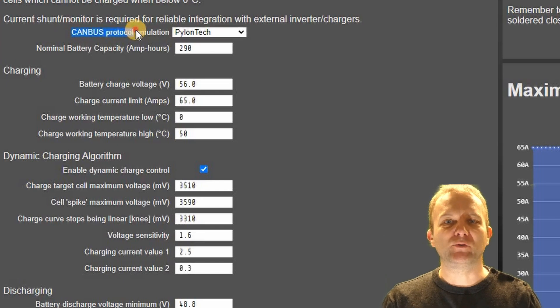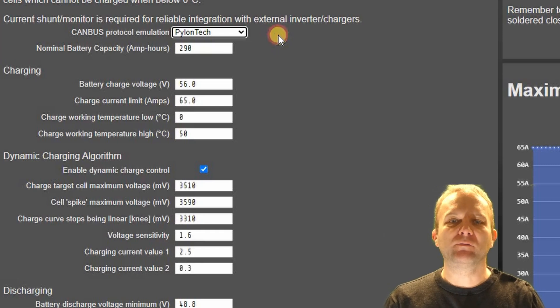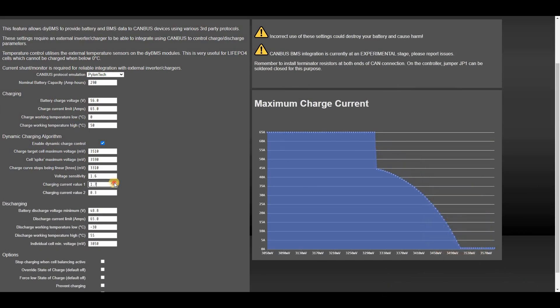This is a dumb charging option and is likely to cause the cells to exceed their limits in all but very well balanced packs. If dynamic charging is enabled, this will calculate the charging voltage automatically — it doesn't change the current, just the voltage. This might seem a little odd, but it's actually the Victron recommended way to control charging and forms part of their DVCC system. Ultimately, by changing the voltage, Ohm's law kicks in and automatically limits the current naturally. You might want to control the maximum current though, which is what the graph on the right hand side resembles. This allows you to set the maximum current for charging based on the high cell voltage, and you can tweak the graph shape using two values and hover over the graph to see what the current would be at that particular cell voltage.